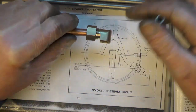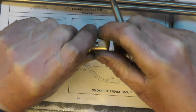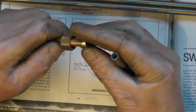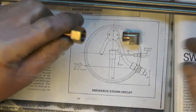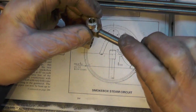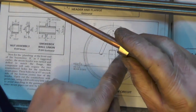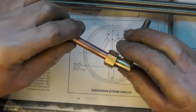So the superheater pipes come up the full length of the boiler. One pipe is the feed to the cylinders, and one is the feed from the wet header. Let's deal with the wet header first. Steam comes to the wet header, and I've got to connect this stainless pipe to it. I've made this adapter - it's basically very similar to the adapters used on the non-superheated type. It's a nut and an olive, silver soldered flush on the pipe to give a square face to tighten up to. Then I've made this little adapter with a half-inch cycle thread. This copper pipe will be soldered onto that, then this will screw on separately. Once I've annealed the pipe, I'll bend it to the shape needed to go into the wet header, then silver solder it as per the standard one. That covers the feed pipe.